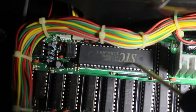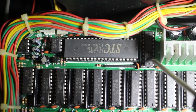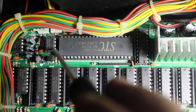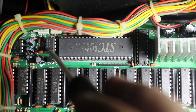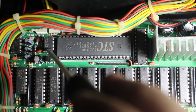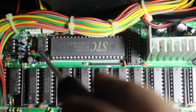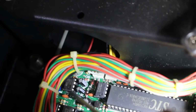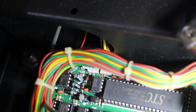Okay, so on the inside I think this is the main microprocessor. Unfortunately I'm not familiar with it. Next to it is a 74HC245. I'm not familiar with that chip. Next to this, I think that's National Semiconductor, it's just a 75176, or it's a 485 converter chip that handles all the DMX. Next to it, if you look closely, there's a small mic and a LM358N op amp.